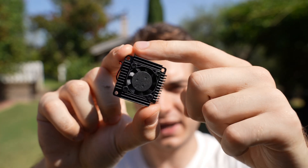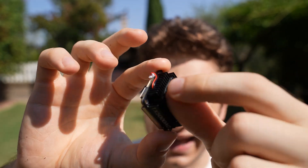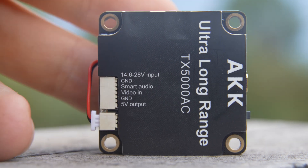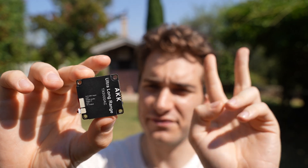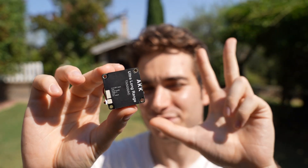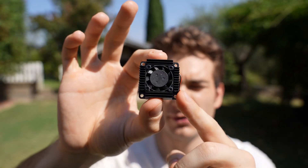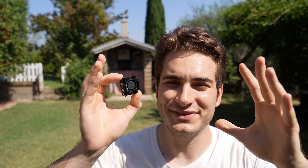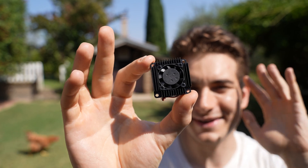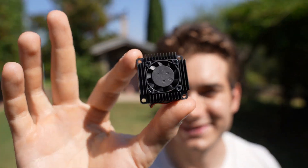Let's talk about specs. It is 36 x 36 x 14 mm, 25 grams of weight, and the mounting holes are 30.5 x 30.5 M3. It is power switchable between 25, 200, 500, 1000, 3000, and 5000 milliwatts. Input voltage goes from 14.6 to 28 volts. It has a very wide spectrum with 12 different bands and 8 channels per band — 96 different channels total, going from 4900 MHz all the way to 6060 MHz. Crazy.